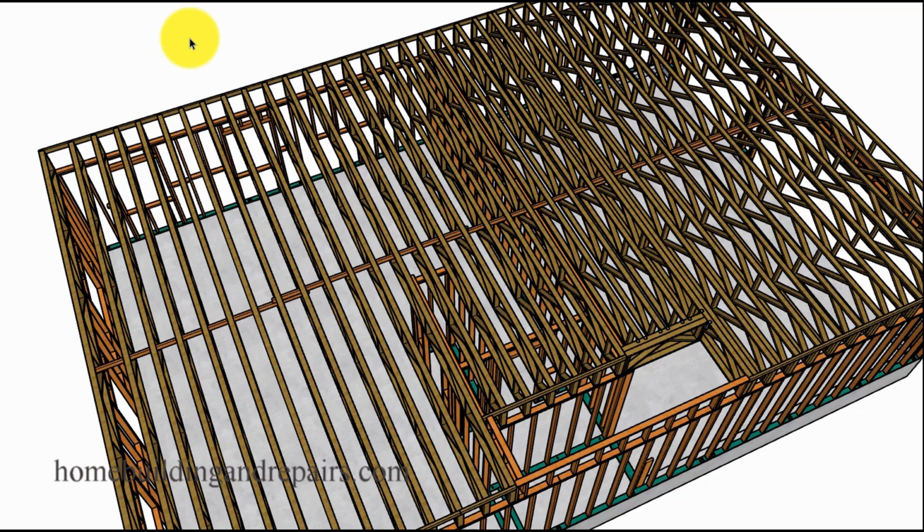And a hip roof is also going to create problems for you with your strongbacks, because you're not going to be able to set them on top of a wall. You might have to connect it to a rafter, and that's going to be creating more of an issue for the roof rafter when you start putting a lot of weight on it.